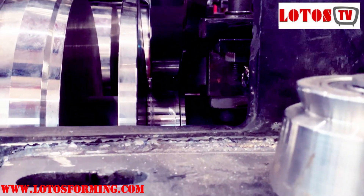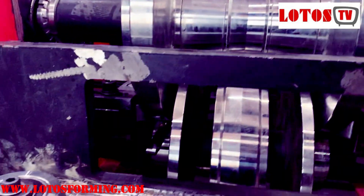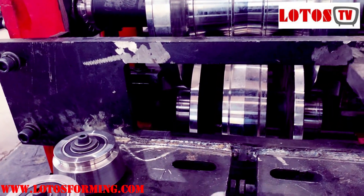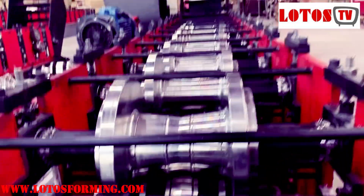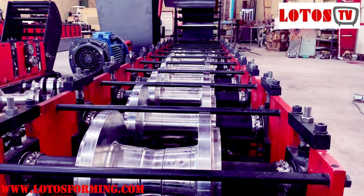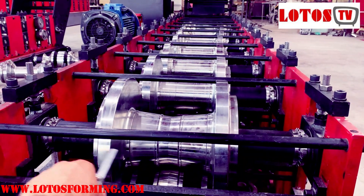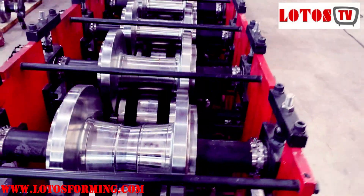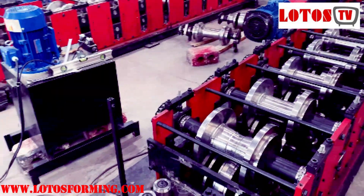The left and right should be at the same distance. By using this liner and this spacer you can check and make sure the left and right are the same, so the rollers should be at the same level. First, make sure they are in the same level, and second, make sure the left and right are both at the same distance. This is how you fix twisted final products.